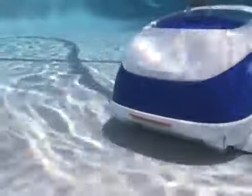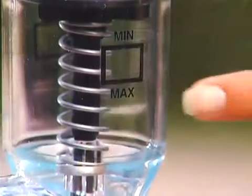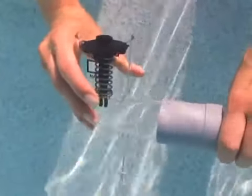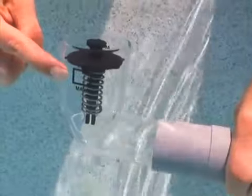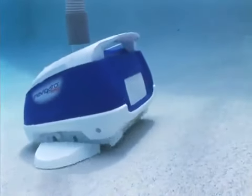After the cleaner has been properly adjusted, remove the flow gauge. This gauge is not designed to be left in the water and is not guaranteed from water damage for unnecessary use. However, the flow gauge should be reinstalled from time to time to verify the flow readings, as it may change as the filter system accumulates debris. This will assure that your pool cleaner will operate as designed.